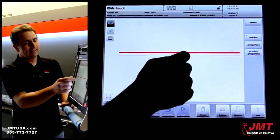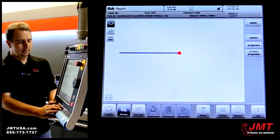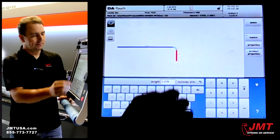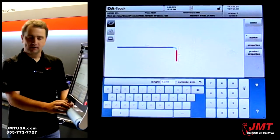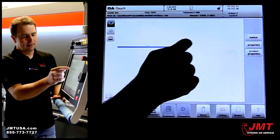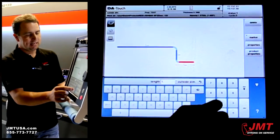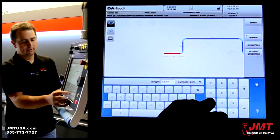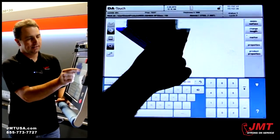It's such a cool feature — this can be any line segment on the profile of your part. I'm going to select this line segment to be 5 inches long. I can grab my part and drag it to center it. I simply touch where I want the bend to go. This interpolates where you touch, trying to anticipate what you're doing — whether you're shooting for a side angle or a 90-degree bend. It's very intuitive. I'll assign a flange length of one and a half inches, check my angle — it's 90 degrees, which is what I want. I touch again on the other end. Here's my part, and I can also see it in 3D — a really cool feature on this DA69 control.